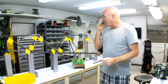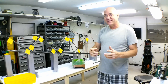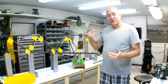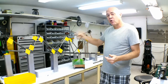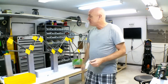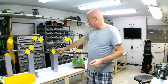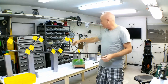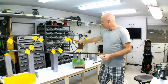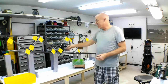I wanted to do this little demonstration to show you the different degrees that these half-inch 4130 chromoly tubes are running into the 5/8-inch chromoly. Back here we've got 35 degrees, 27, 68, 60, 47, 39, 54, 46, 54, 47, and 51. Now the 54s are close enough, and the 47 and 46 — the 47 is close enough.